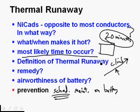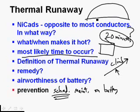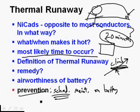But when that AD came out, they started putting temperature gauges in airplanes that had NiCad batteries, and they put them in some obscure place. So, for instance, if here's the instrument panel, and let's say it's single pilot IFR, and you're sitting over here, and they put the battery temperature gauge way on the other side of the instrument panel, you're really going to have to look for it. So when you're going to look for it more than usual, you're going to look for it in a climb. Prevention, I already told you that part. Get the battery maintenance done on time.